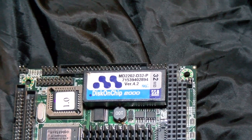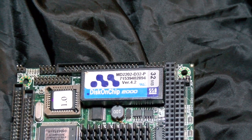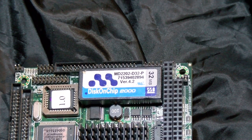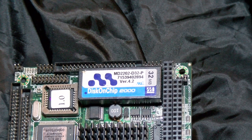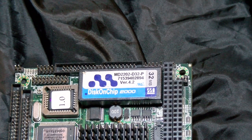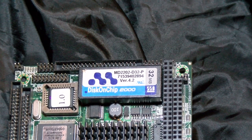Now, this is a little disk-on-chip at only 32MB. Internally they use blocks of flash memory, not unlike a modern SSD, but they fit into a DIP socket and obviously don't have quite the level of resilience you'd expect today's drives to have. However, this isn't usually a problem, as write cycles should be quite low — which is just as well, because writing to it can actually be quite slow on occasion. You're not even guaranteed that many writes to a given block before things wear out. While these would have been used, you'd basically start the OS and run whatever program from this without ever really having to write anything to it. In a kiosk it's just going to run the same boring sequence of events all day, and in a factory, any writes to the system would probably be made via another system and then read in from external media.